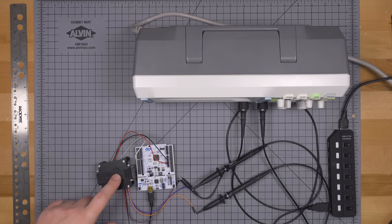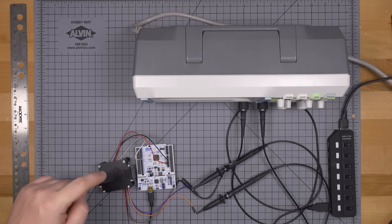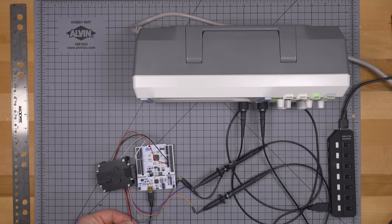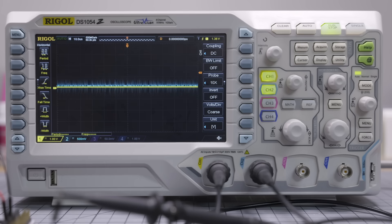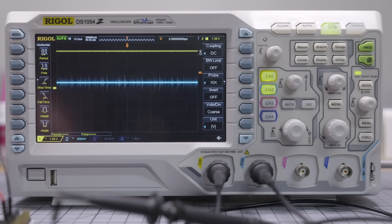Now let's see if the photodiodes in this fixture behave as expected. There's a board ready to go in the fixture, the LEDs are being commanded by the Nucleo, there's power and ground for the amplifier circuit, and I've got the oscilloscope hooked up to the outputs of the two photodiodes. What we're seeing on the scope is the response with the LEDs off. Turning the LEDs on, we observe a big jump in signal. Now I can cycle through the colors — the blue trace is where the LED bounces off the reflective film, whereas the yellow trace has the LED shining right into the photodiode. The yellow trace doesn't move when I cycle colors because that channel is saturated, but that's not a big deal — I can tell the LEDs are working correctly, and I could fix this by just giving the LED a lower brightness value in software. I think I can say that the photodiodes are working correctly.